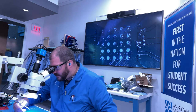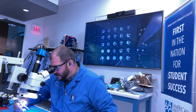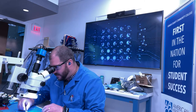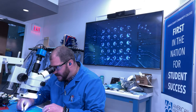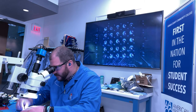You shake all the balls so that one ball falls into each open area of the stencil. Then you lift the stencil up — you pray to whichever religion you believe in, or knock on wood, whatever it is — and you check to make sure there is a ball inside of each port. Because this is a BGA chip; this isn't some little chip resistor where if a portion isn't connected it'll still kind of be functional. No, if one of these connectors isn't connected, this chip's not going to work. The graphics processor, the WiFi unit, the Bluetooth unit — none of it will work. And then you've got what us engineers call a problem.